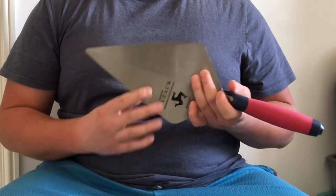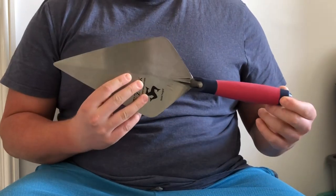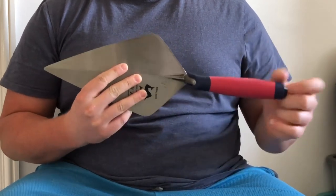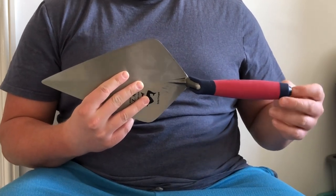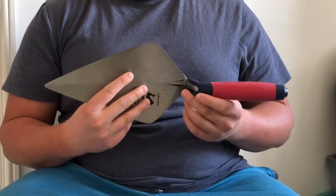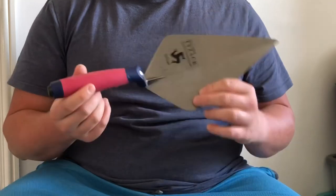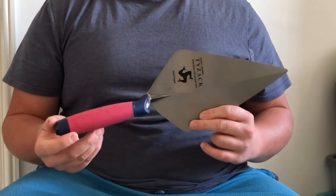The only downside I've experienced with these trowels is that the end caps can come off — on the wooden versions especially, both my end caps have come off. I recommend either getting a bigger screw and screwing the end cap in tight, or using some epoxy resin to fill the screw hole and then epoxy and screw it at the same time. Even if the end does get a bit dinged up, you shouldn't really be tapping the brick with the end of the trowel anyway — though this can mainly happen on blockwork or footings.